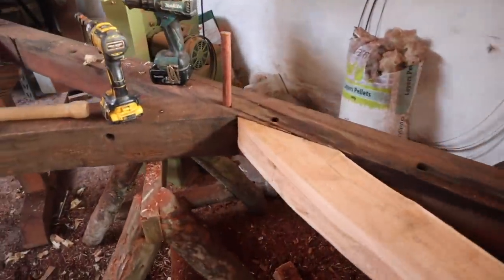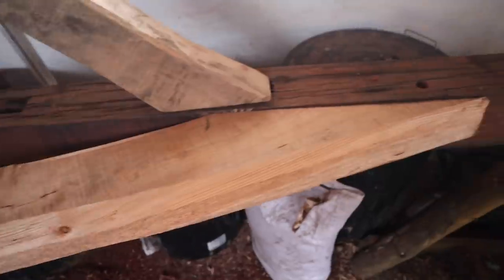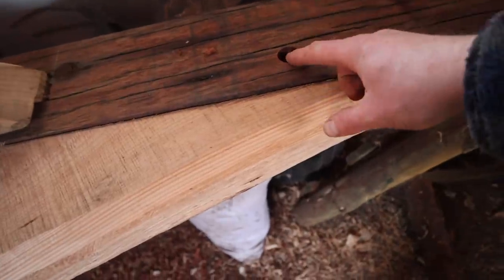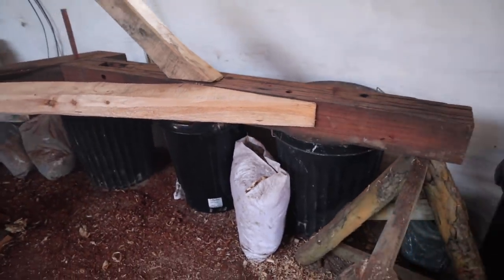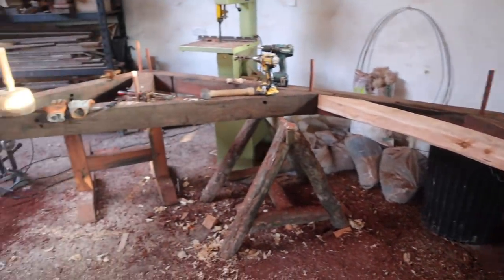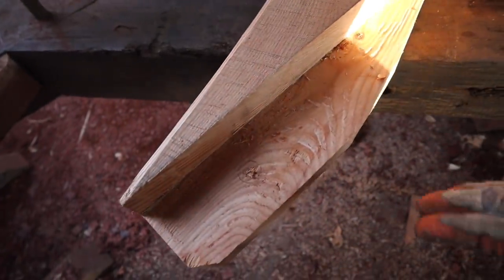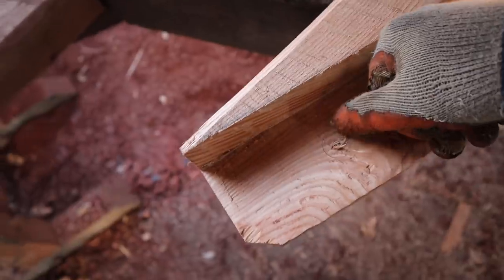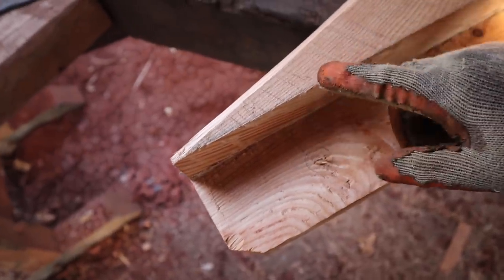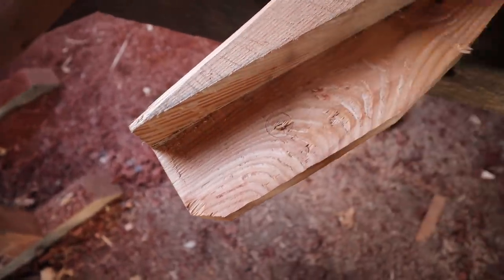It's the next day and today the frame is going up, so the wind braces will fit nicely. I've marked the holes and just got to drill those out — obviously offset a little bit for draw pegging. Do that once, take it apart knowing they'll go back together. Exactly the same method as before — the draw pegging on the tenon: there's a mark, we'll mark four mil over closer to the shoulder, and when that peg drives in it's going to pull that shoulder tight, and that gives us all our strength.